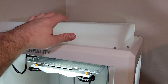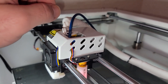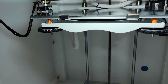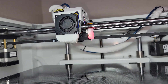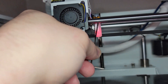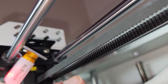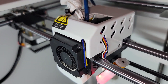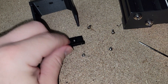The first thing we're going to do is take off the top of this and set it aside. Now we have access to the tool head. We need to take this cover off by removing the screws that go to the BL touch, which you can get to from underneath. We're going to move the Z axis out of the way to access the BL touch screws and the rest of the tool head screws. We'll take off the BL touch using one of the allen wrenches that came with your printer — just a screw here and a screw there. Once the BL touch is out of the way, there are two more screws going to the bracket that we also need to remove to get this cover off. Once those screws come out, the bracket kind of falls away, so make sure that doesn't hit your build plate.